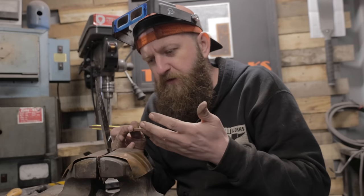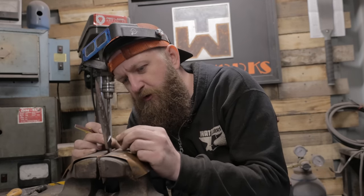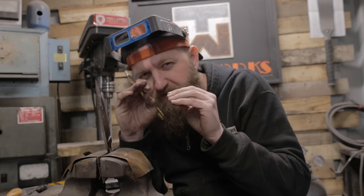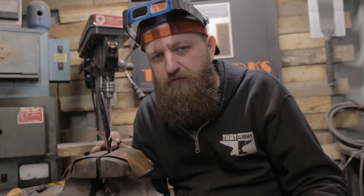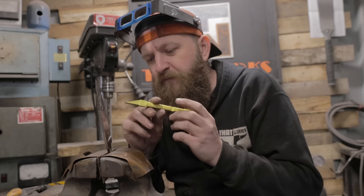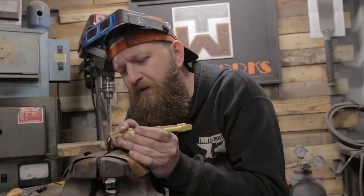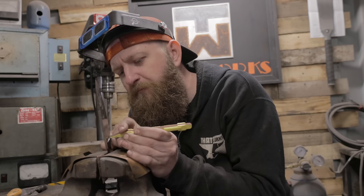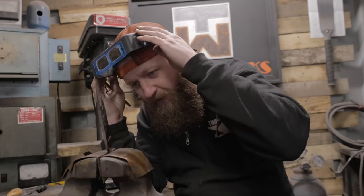So one of the reasons I've referred to this blade as almost good enough was the fact that my plunge lines are almost perfect, but this one side had a little step to it. The other side was perfectly radiused, and this side had a little step. And I kind of was like, well, that's not good enough for my set. However, I just got these handy little hand sticks where I can rotate fresh grit as I go, and it's allowing me to sand that out slowly but surely and possibly get the knife to a condition where I do feel good about it.